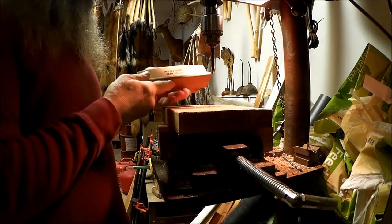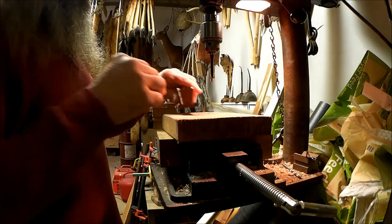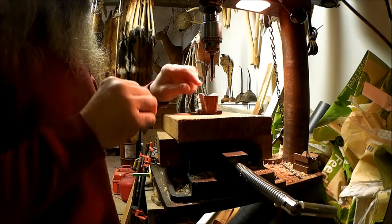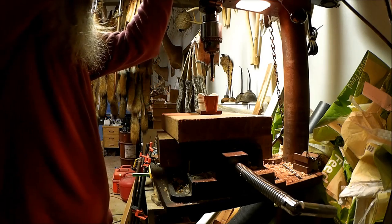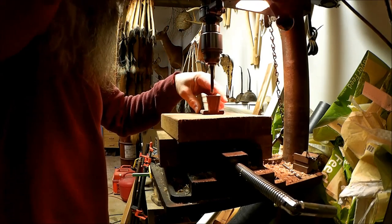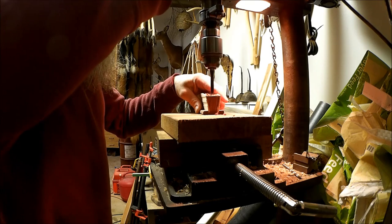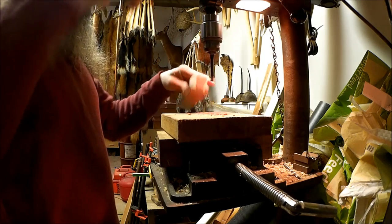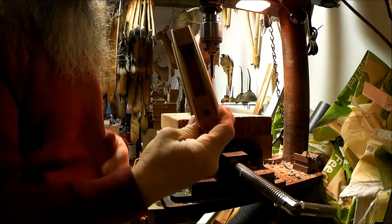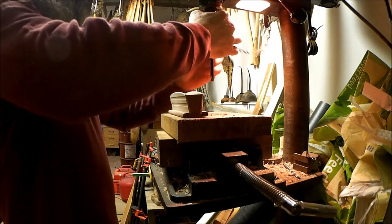All right guys, we got the call out of the clamps. Glue's all dry. Now we're going to put a 3/8 hole in the end block here to accept the spring. Here's the hole for the spring. Now we got to put a hole in there for the screw.